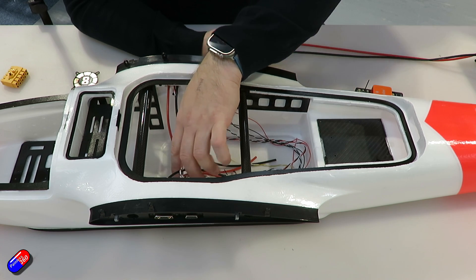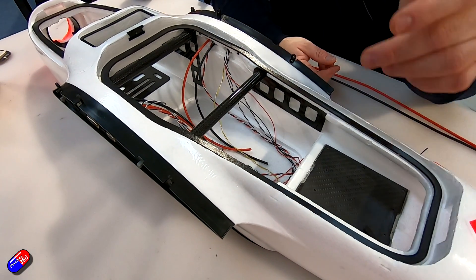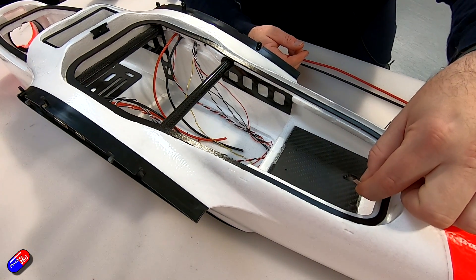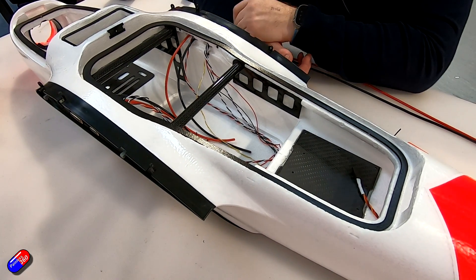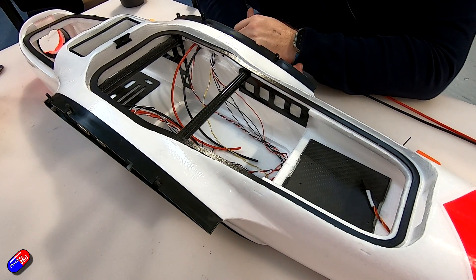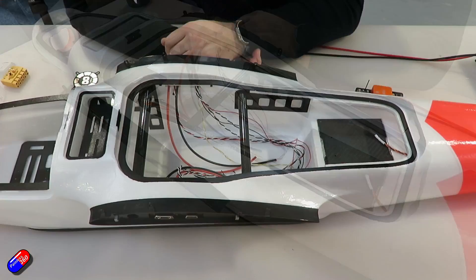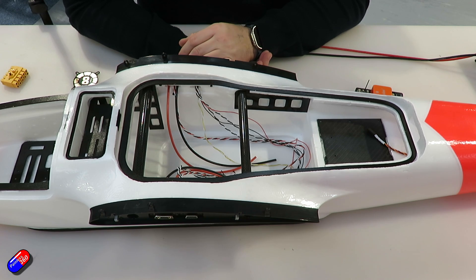On this particular one we did put a few wires in already — the kit does come with some wiring. We like to cut cable to length and terminate our own ends, labelling them using our little heat shrink label printer, so we can mark what everything is connected to. All the foam is glued with UHU POR. We use a push-and-release method, then tape it up and leave it for a day. I'll glue it up one day and not work on it until the next.